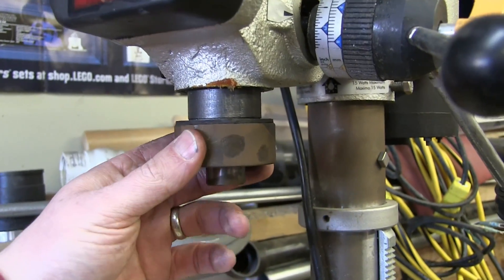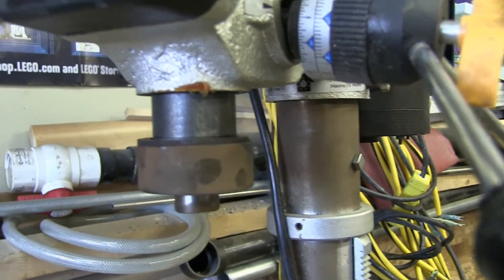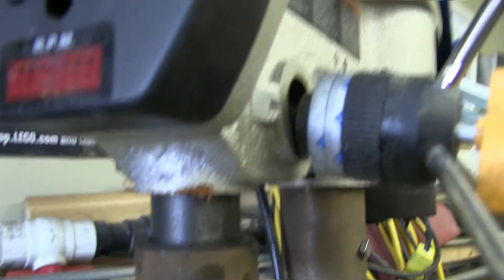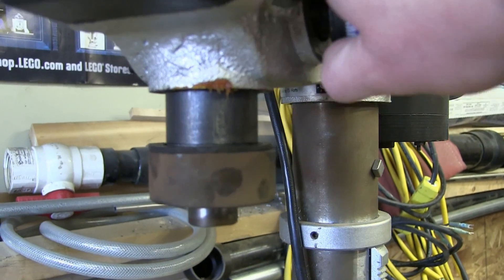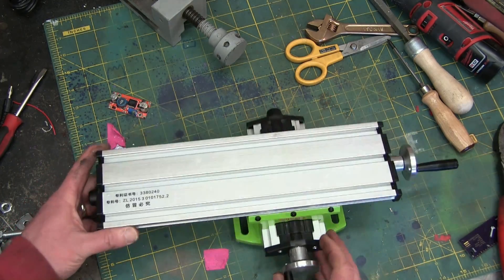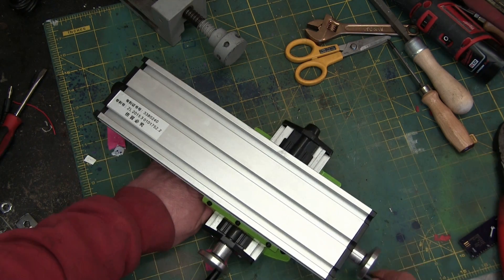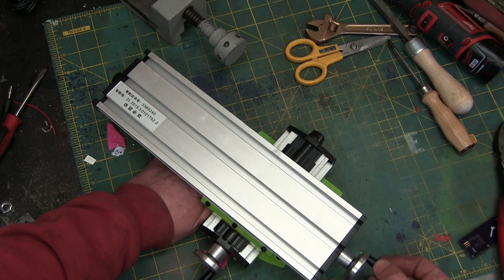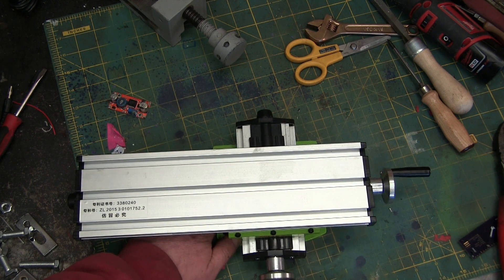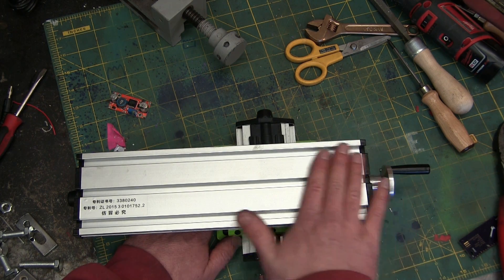So that's the problem we need to overcome — this Morse taper. Now on the drill press, the quill is actually a rack and pinion gear set. We need to take that out; in order to do that we just take off the cover here from this side, then pull the pinion out and this guy will fall just like that. The other thing we're going to need for a milling machine is an XY work table.